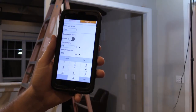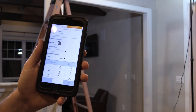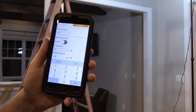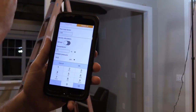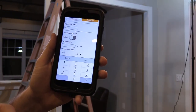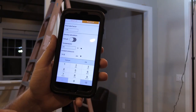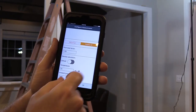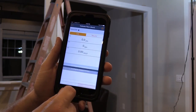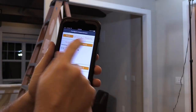You can also use standard air or set a different density calculation based on the temperature of the air. Let's say we want to set this at 74 degrees temperature — that's about right. And we can actually set a different ambient pressure, which normally would be 14.7 psi at sea level, but I have a barometric pressure app that shows me the station pressure right now where I am — we're at 14.90 psi. So we're going to change it to 14.9, which will give us a slightly more accurate air density reading. I pulled the disconnect on the condenser for this very reason: if it was running in cool mode, the temperature of the air would be consistently changing. By pulling it, we know the air in the supply duct is going to be the same temperature as the air in the return, giving us a better air density reading.